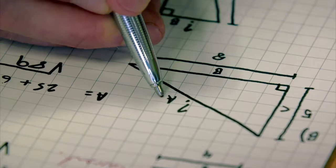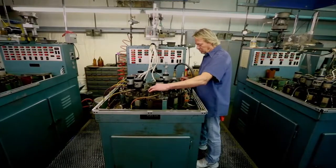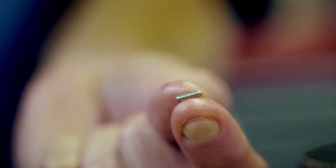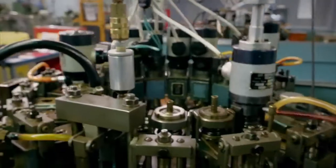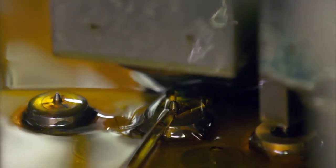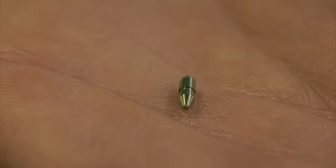The most crucial part of the ballpoint pen is its nib. Danny carves them out of short lengths of steel using this ingenious machine. It has 18 stations that transform the steel blank into a nib and position the pen's 1/25th of an inch ball inside it. There's just enough clearance between the ball and the socket for it to rotate. If they're not perfect, then they can't go out the door.